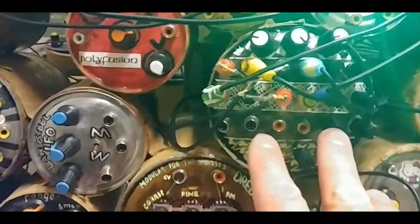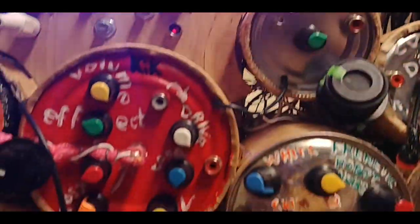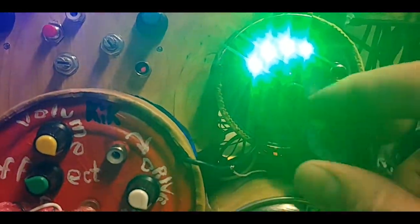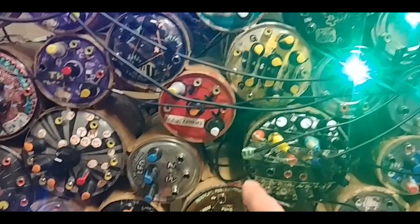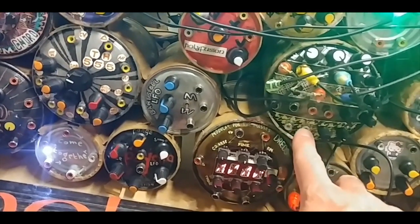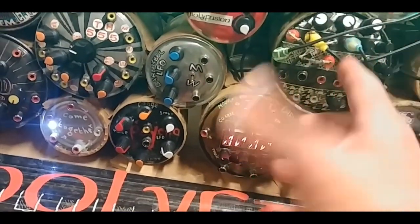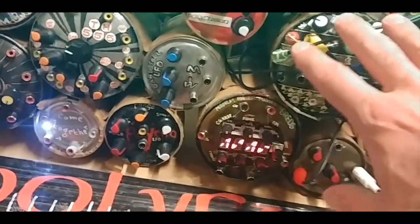This is my stereo mixer that is also a ducker. Here's a kick drum. Every time the kick drum hits, this envelope follower goes up. This knob turns up the gain for that, that goes down to this module, which ducks everything based on that envelope. So this has one, two, three channels with two stereo inputs per channel, and then one extra channel that's just mono. And each of these has a VCA built into it, stereo VCAs for the top three, and of course a mono VCA for the mono channel. So that VCA gets ducked.